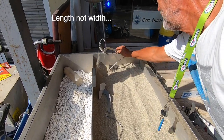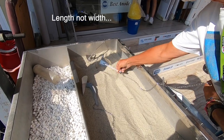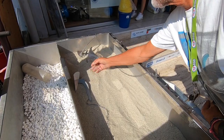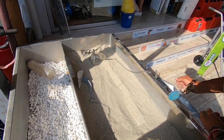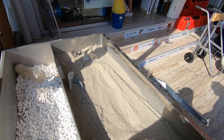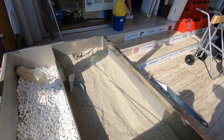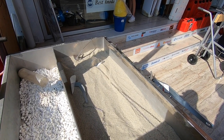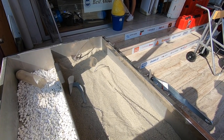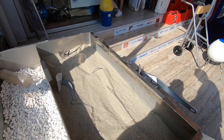So then a Mantis has got good, much heavier and good tip weight. So same thing, we'll pull that in. You've dropped your anchor, you start to come backwards now, and see how quick the Mantis pivots round and starts to dig, and that's half its length. Maybe its length before it bites in. Then of course it just disappears under the sand, which is what the Mantis does.